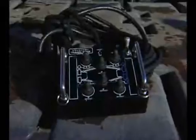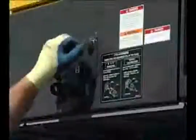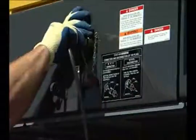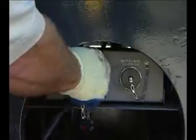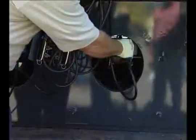The two cables to operate the remote box for the translifters will now need to be connected. One is for the power supply from the upper structure to the lower car body; the other is the control box itself. Turn off the engine and connect one end of the power supply cable to the receptacle on the right side of the upper structure and the other end to the lower switch box located in the main car body of the machine. Then connect the control box cable to the switch box.